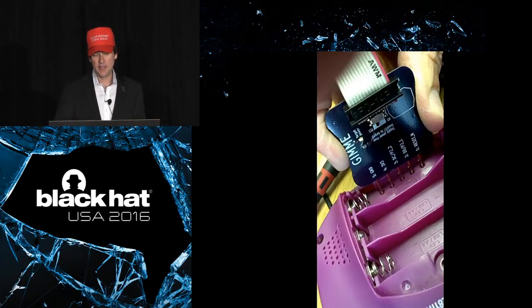In this case, the chip that's in the IMMe is another chip from Texas Instruments, but a completely different CPU architecture, completely different debug interface. Travis just thought it was a cool toy, so he implemented that debug interface. And we could use the GoodFET as a debugger for the IMMe. That let us do a number of things, but most significantly, we can read or write program data to the thing, so we can create our own software for the IMMe.